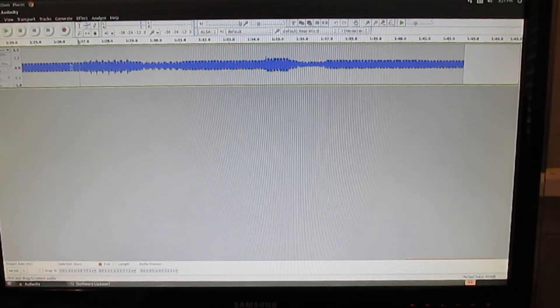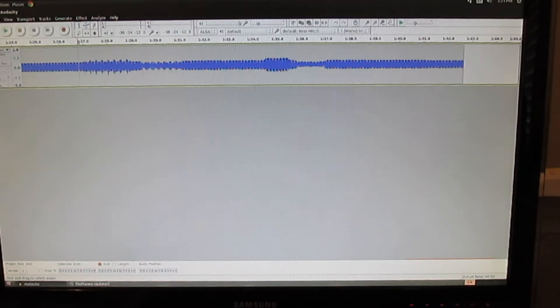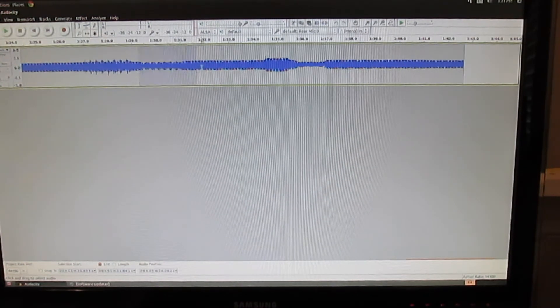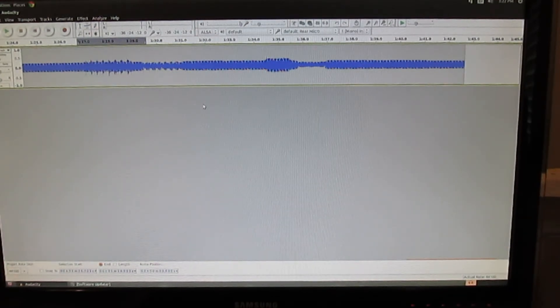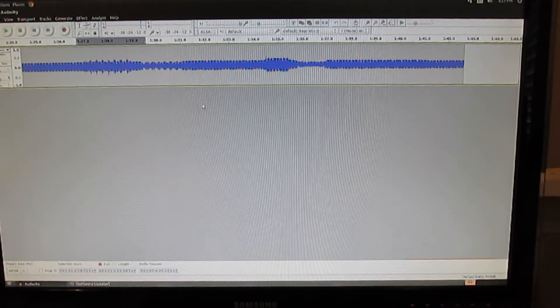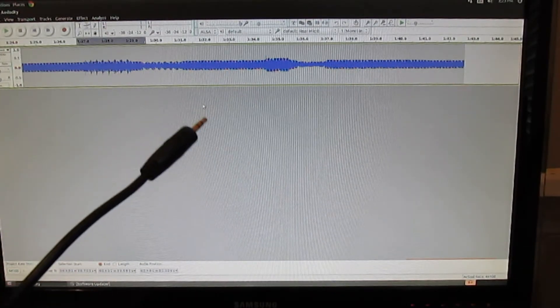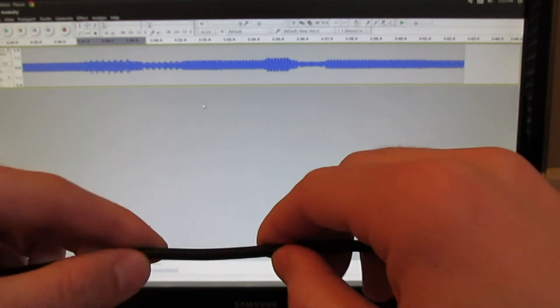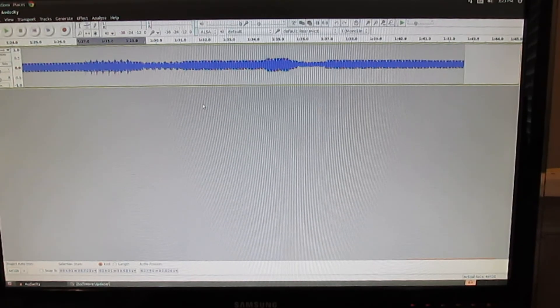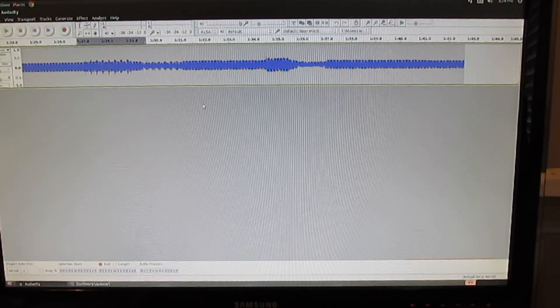I could adjust the common mode knob to try and get rid of some more of the 60 Hz and get a better listen at what's going on, but I don't want to have to adjust it again. I think I do have enough data to show what's going on here. I don't have a solution to the problem, but I do have a better idea — I think it is piezoelectric noise. Maybe I could improve it by using a cable like this audio cable for my electrodes, since then I wouldn't be able to rub the insulation on the wires inside. For now I'm just going to not touch the cable and move on. In the next video I'm going to talk about all that white noise I had when I had nothing connected to the inputs at all.